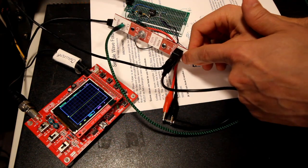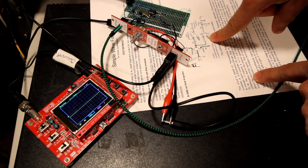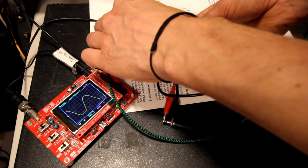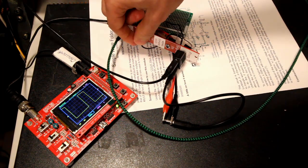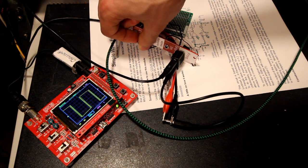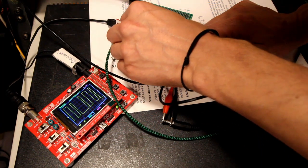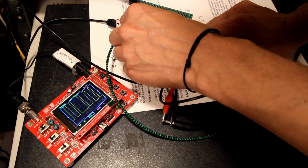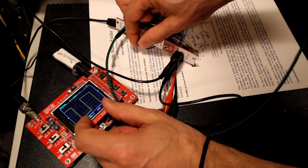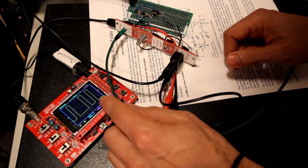Now this one has a pulse output as well, just going through a comparator with the threshold at ground. So even though we here have a sine wave going in, if we take the output here, we have a square wave — a really interesting effect. This would be somewhat similar to the wave we had from the beginning, and here we get, from each positive wave, two pulses.